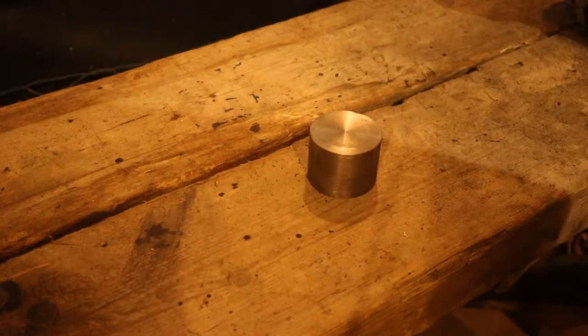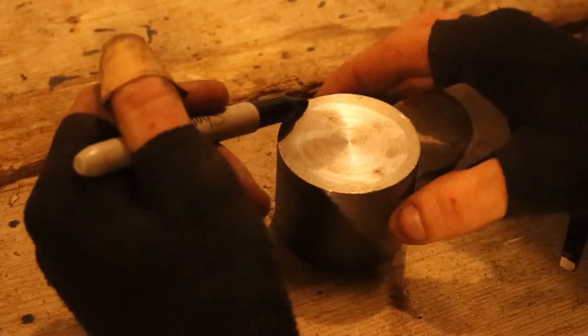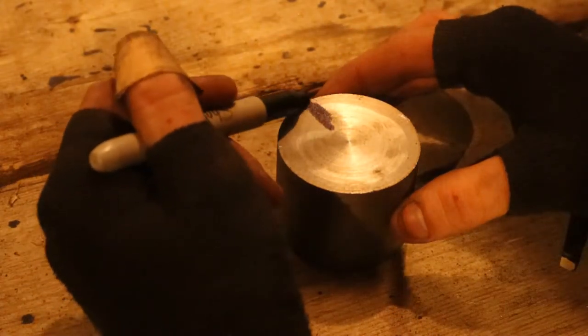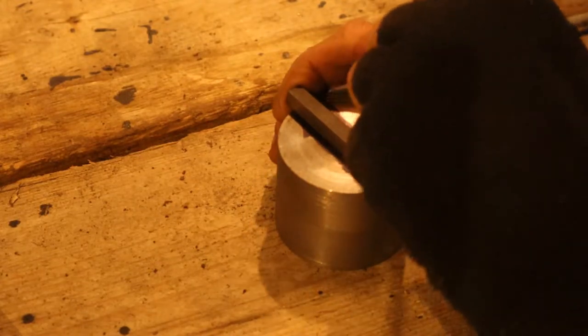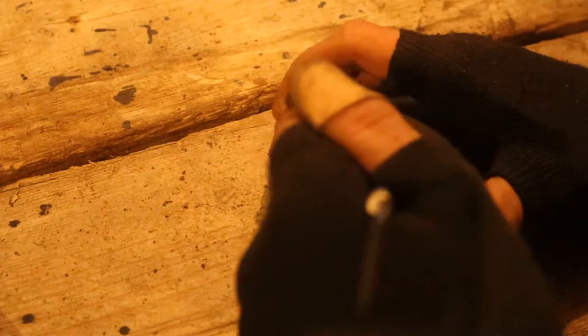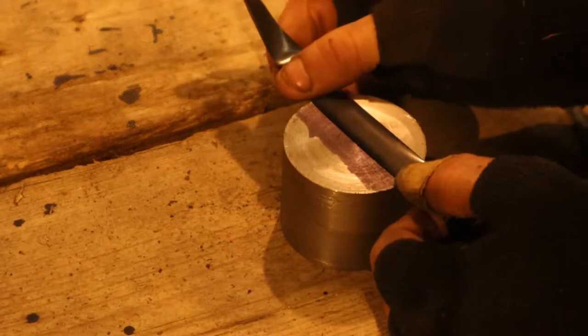This was certainly the most confusing part of the build, since the cutting edge of the tool must be collinear with a radial line from the center of the fly cutter, and on top of that you need to take the direction of rotation into consideration. It was a whole ordeal of second guessing yourself, because you really, really want to get it right the first time.